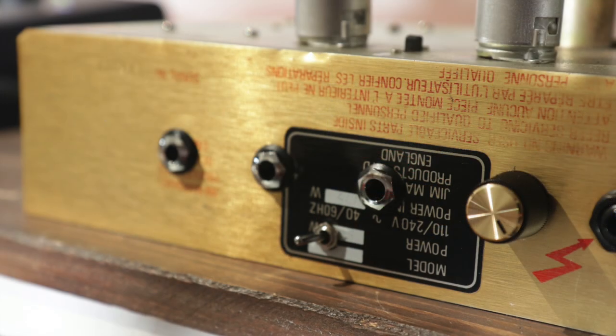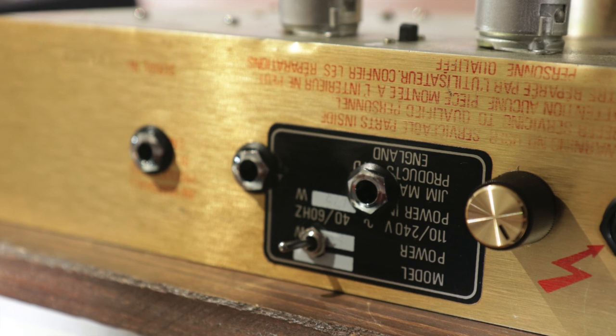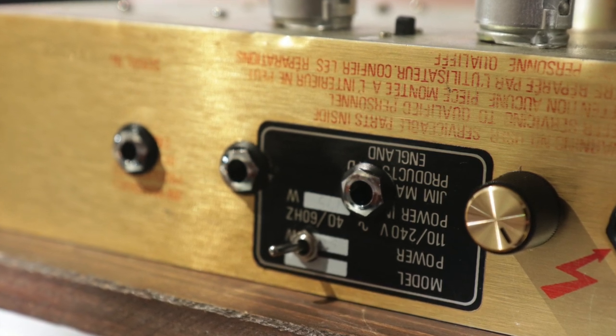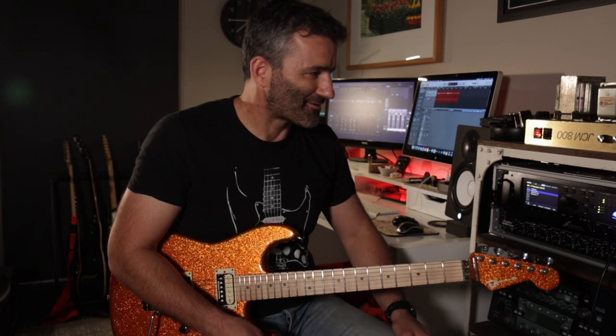We've also put a variable depth pot on the rear of the amp and installed one of our high voltage effects loops. It's a Metro style effects loop board, and obviously a footswitch jack as well. So yeah, it's been a busy week on the bench with this one. So let's go through some main tones and give you a sense of the versatility that this thing's got now.